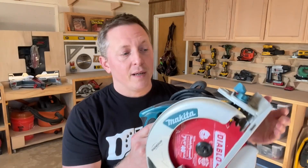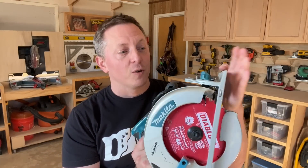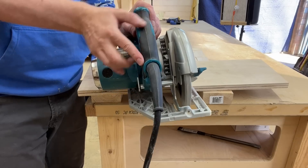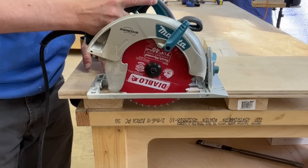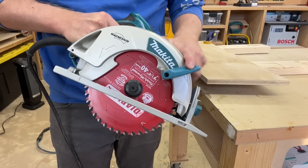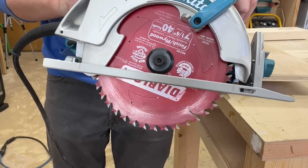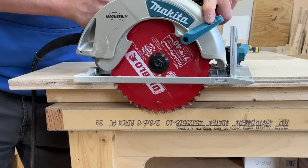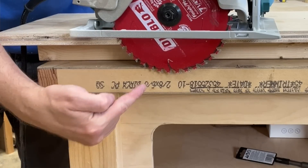The sole plate is a crucial feature for stability, safety, and depth control, and it can't do its job if it isn't tightened down. We set our sole plate level to control the depth of our cut. This keeps us from having too much blade extending through the bottom of our stock. Excessive blade depth presents three dangers. One is that it increases the potential of cutting through something beneath your stock. You can get two and a half inches of exposed blade on most seven and a quarter inch saws, so on three-quarter stock you'll have an extra inch and three quarters hanging free, hacking things up down there.